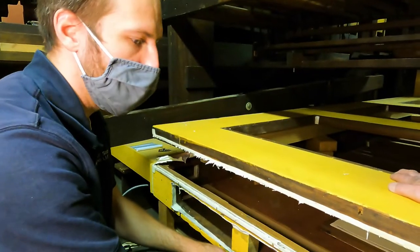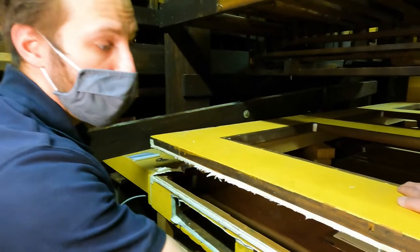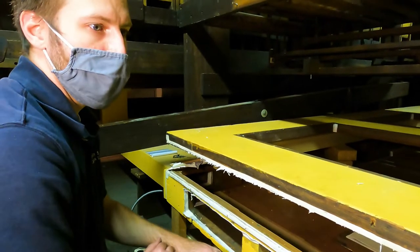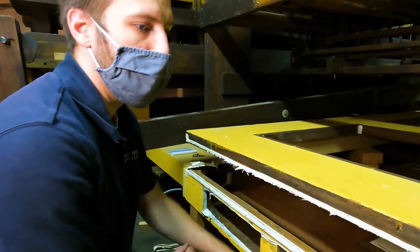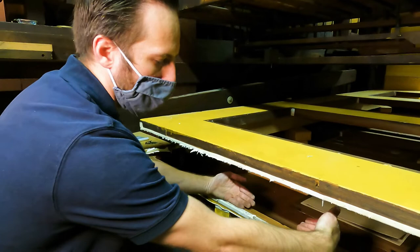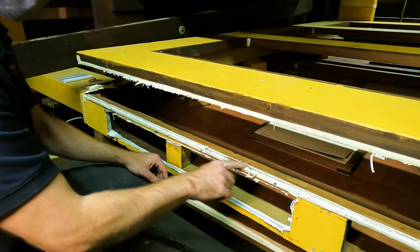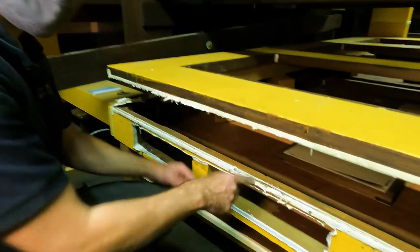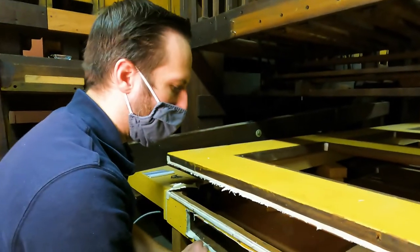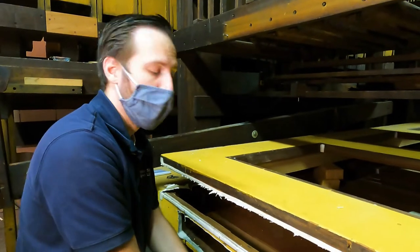The hinge material will often be fine whenever gussets go bad. And so sometimes you don't have to replace that or even the leather that covers the ribs. You just need to replace gussets and the caps. But in this case, when I came and saw that there was cracking all over the place, I knew that it was going to have to be done. And the thought is if dirt or soot is coming through enough to blacken the leather, it means it's coming through the hinge material as well, and those particles just rip that up, so that acts like grit. Yeah, exactly. We knew it was going to need to be done. This just made it very clear that it didn't have much time left on it before it was ready to go.